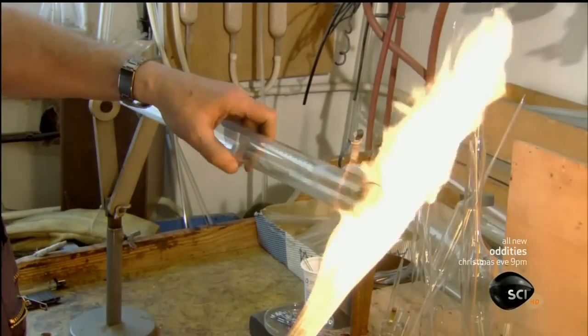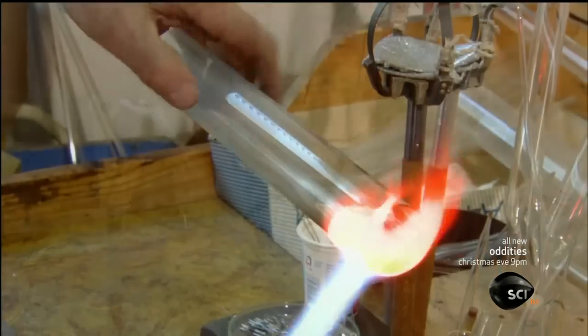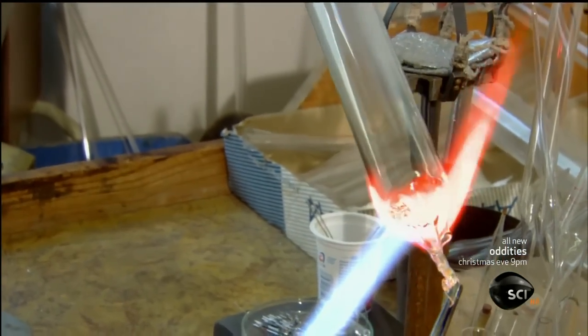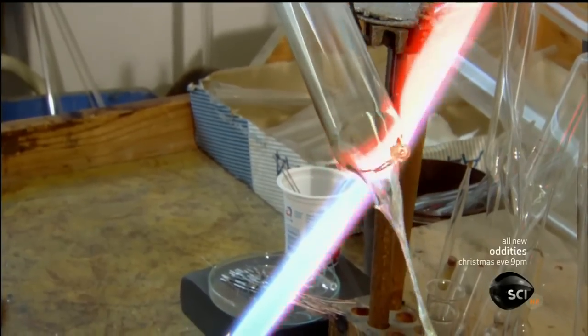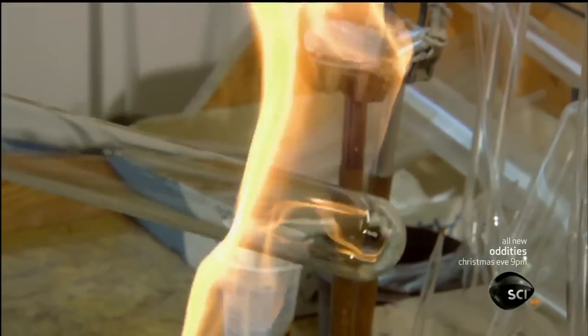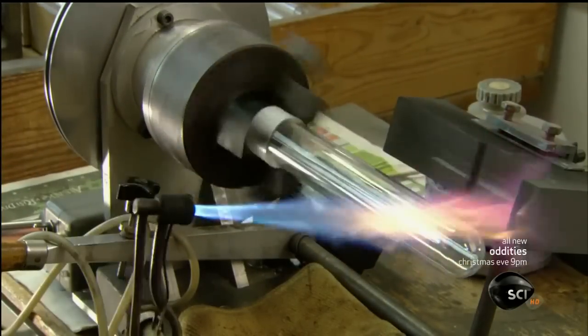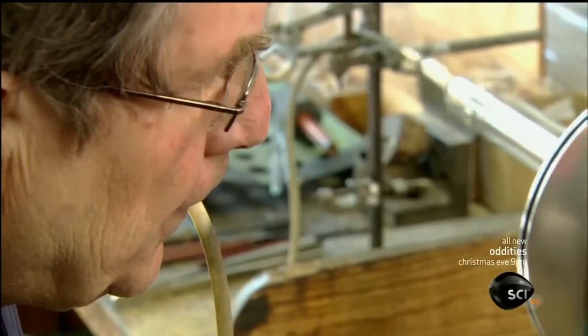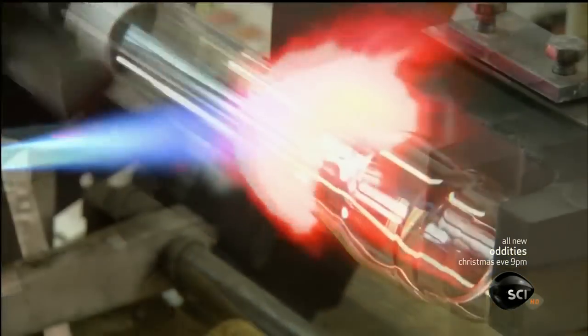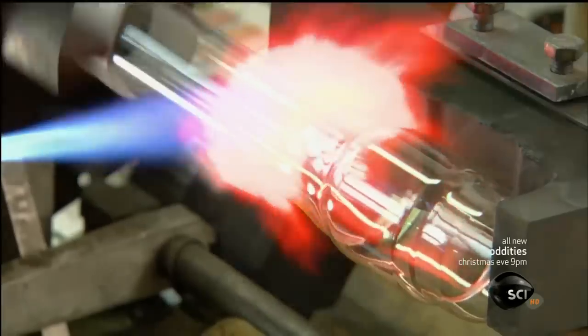Now for the bulb, which will encase the unit. A glass blower skillfully crafts it out of hard laboratory grade glass. Using a high temperature torch and glass making tools, he melts the open end and seals it off. Then he blows in a bit of air to shape the end into an evenly rounded dome. He mounts the bulb on a lathe to complete the shaping, keeping the glass evenly heated and blowing in just enough air pressure to keep the bulb from collapsing inward. When the glass reaches just the right temperature, a die presses against it, setting the final shape.